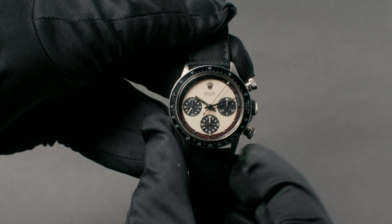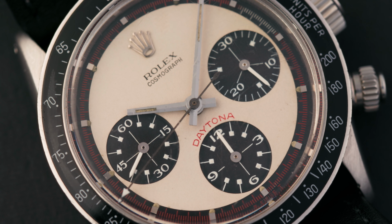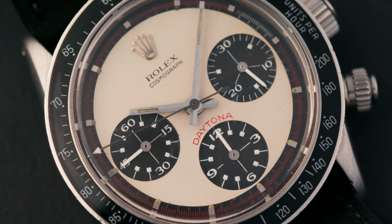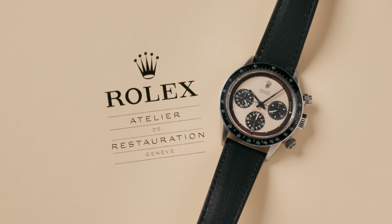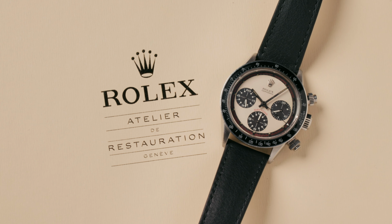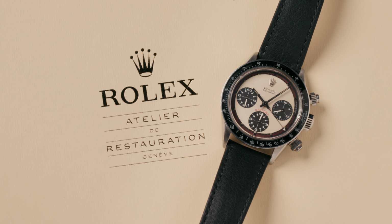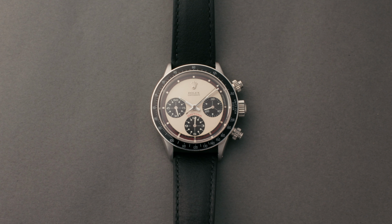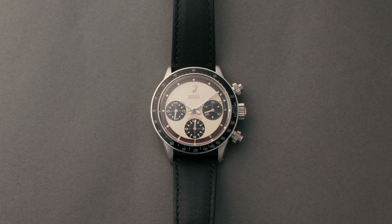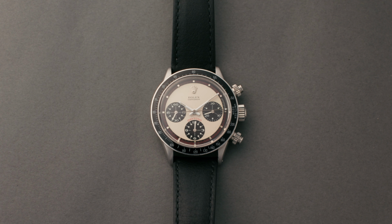You can see Rolex modifications include significant upgrades to the aesthetics of the bridges, the wheels, and the components. Manual wind with a 2.5 hertz beat rate and a 48-hour power reserve. It beats away on a regulator highly modified by Rolex. You can see they've gone with a free sprung balance, and they've also equipped a blued Breguet overcoil hairspring for isochronic operation in every position.